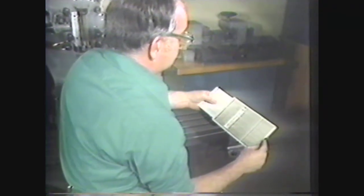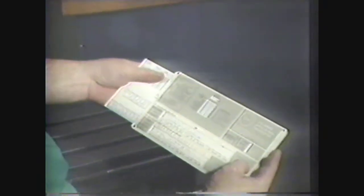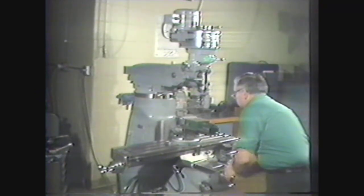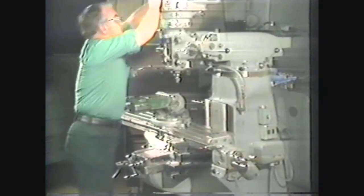For feed rate, for soft steel with a one-inch end mill we can take from two to five thousandths per tooth. Using two thousandths per tooth will give a smoother finish. A calculator setting for two teeth at 325 RPM and two thousandths feed per tooth gives a feed rate of approximately 1.3 inches per minute. Set the feed rate on the table for 1.3 inches per minute. This machine is only equipped with longitudinal power feed, so a hand feed must be used to square the end of the workpiece. Turn on the spindle and bring the end mill down past the end of the work with the spindle lever.